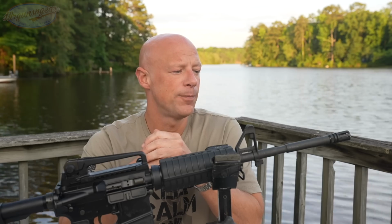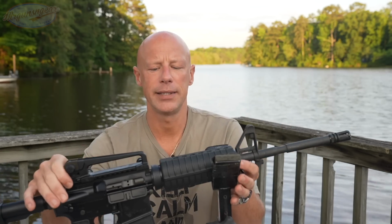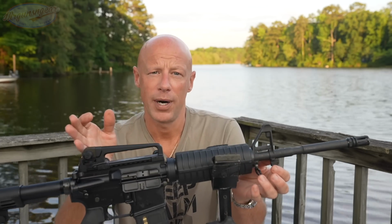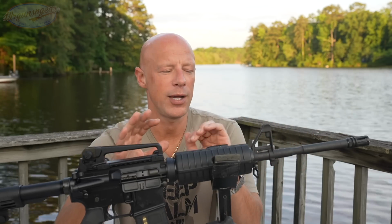So again, that's a historic mil spec thing. And if you think about when the military was adopting the AR-15, when it was creating the mil spec, if you will, it was a long time ago, and manufacturing processes have gotten a lot better. So I still think that MP testing, the magnetic particle testing, is something that you want to look for in a barrel. If you can get it, it's a good thing. It doesn't hurt anything. It doesn't damage the rifle in any way. It doesn't excessively wear it in any way.